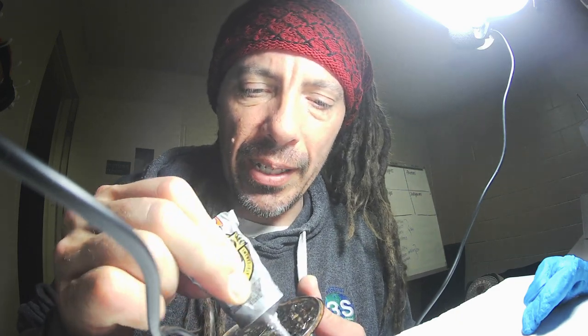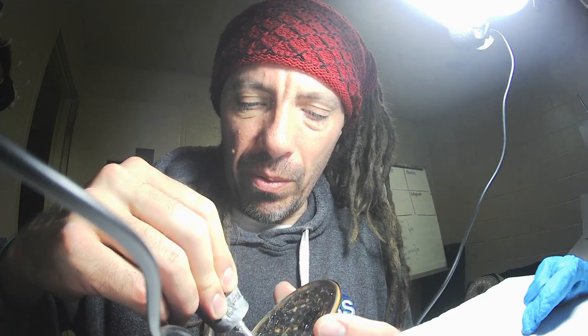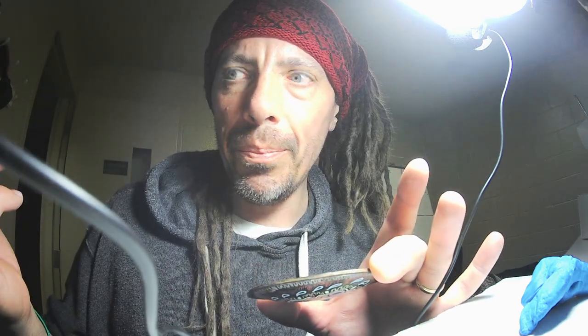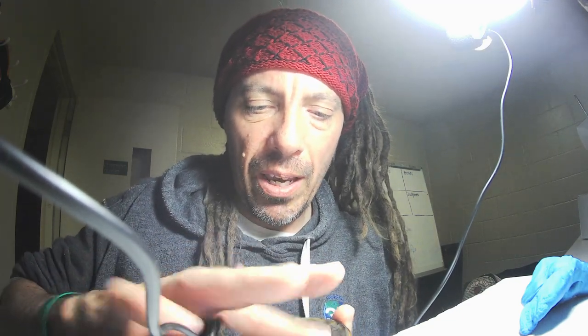I have only had 3D filament things that I've built break once, and that was in my module that has a crossfader. My theory was to make a cut in the front of the module, bend the metal over, making a sort of interference fit. I squeezed the 3D filament under that and then built it up and held the slider potentiometer in place like that. But I was whacking it like this, hitting it to crossfade between the upper half of my mixer and the lower half, and it eventually broke. So I had to redo it with this strategy, which worked fine. It's still working now. That's the only time I've ever had 3D filament built stuff fail on me.